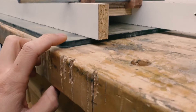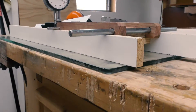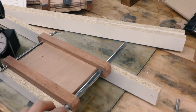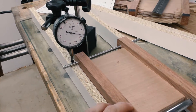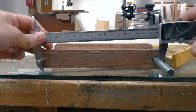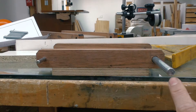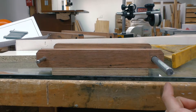I've got an 8mm thick piece of glass on my workbench and two pieces of melamine to raise it up a little bit. I'll set my short link on top of it with a dial indicator in this corner to check for any twist or noticeable movement. So far I think we are pretty much perfect. Now I'm going to check whether they're at the correct distance apart — this is 189, and 189 minus 5 minus 3 is 181, and that's supposed to be 180 millimeters.